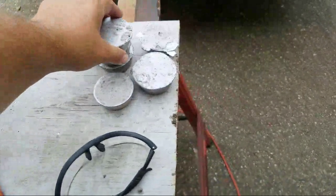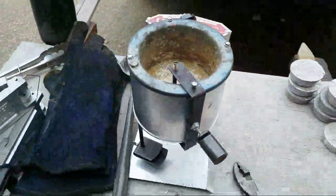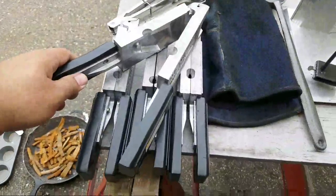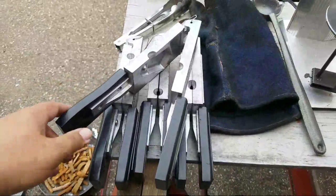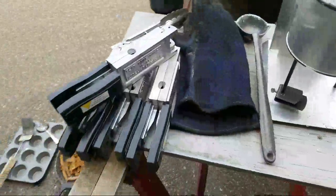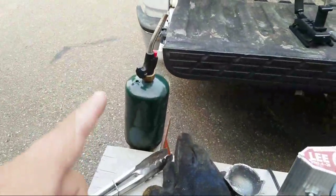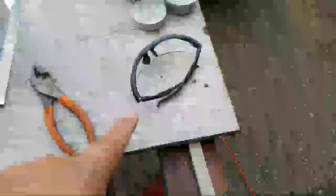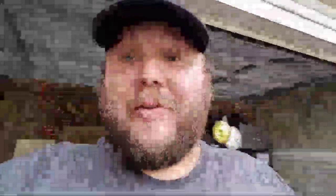All the clean melted lead goes into the muffin pan, it hardens and makes these little ingots — I think these are about three pounds each. That's what goes in here. I have 12 ounce, 20 ounce, 6 ounce, 8 ounce, 3 ounce, 4 ounce, and 5 ounce molds. I usually heat up the molds before I use them, but if they get too hot it's not good. Always want to have eye protection and gloves — that's important.